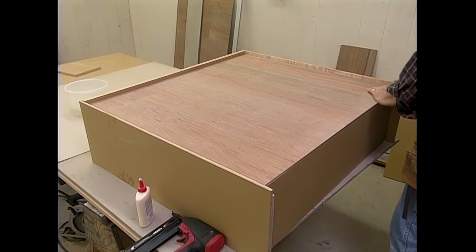While my dado head is still in the saw, I'm nibbling away this notch in the back of the drawer to receive the drawer slides. I've just cut a couple number 10 biscuit slots in the side piece, and that's how I'm going to join the fronts to the sides. Now the biscuits are going to go in the slots, but when I put the front in place, the biscuit is in the slot for the plywood bottom — no problem, I'll just notch the plywood. Now a little assembly: put a bit of glue in the biscuit slots of the side, drop the biscuits in, then a little bit of glue in the slots of the front piece, drop it in place. I'm just going to tip it up and put one nail in the middle to hold it while the glue sets up.